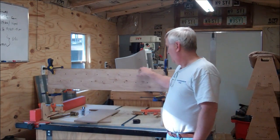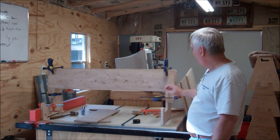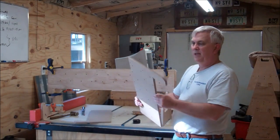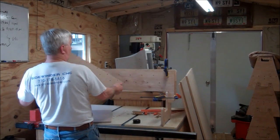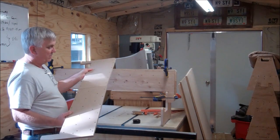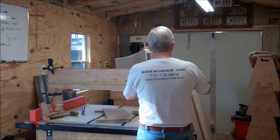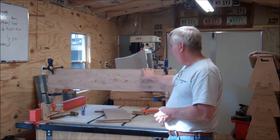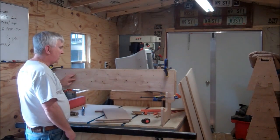I've got a dry fit here with these pieces clamped up to make sure they fit right before I fasten them together. Those MDF templates worked out great. I just made two halves — for the front I routed out one half and then put the template on the other side, butting it up to get the right length. That enabled me to make something that's almost 46 inches — 45 and 15/16 — even though I only have a 40-inch cutting area. It's easy to cheat a little bit if you use MDF templates and take your time lining everything up precisely.